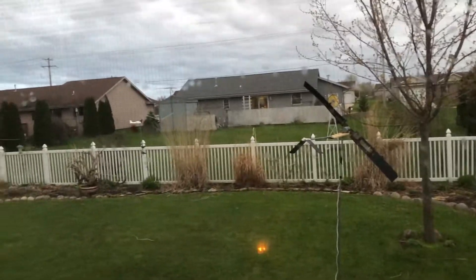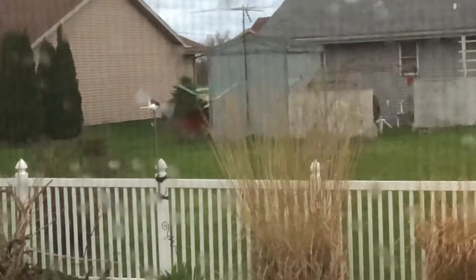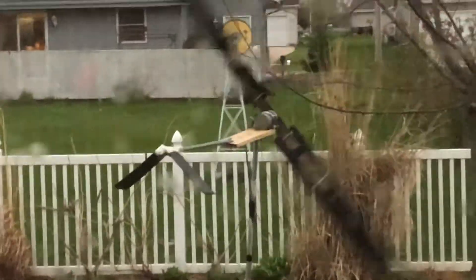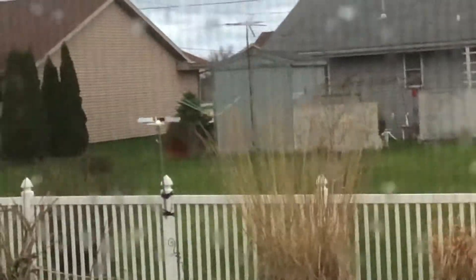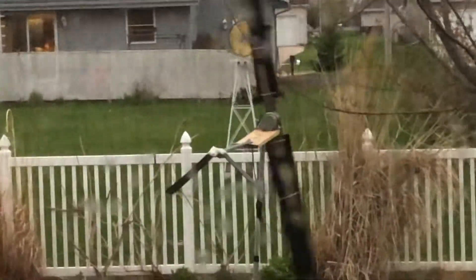As you can see, I got two windmills and it is quite breezy outside. This little one over here is doing quite well — it's a little stepper motor with just an old foam glider body. And this bigger one here has a foot and a half size propeller on it, and this one's got a four-foot. This one is a DC motor — a 24-volt DC motor — and that one's a little AC stepper motor.